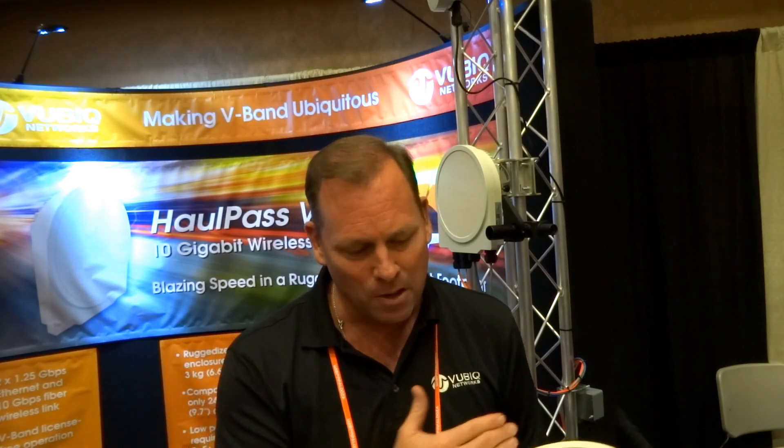If you're using the full 10-gig path, could you plug into one of the other ports for management? Absolutely. When you're going 10-gig, all you see is the MAC address, so it's good to know you can still manage it. The theory is that if you're investing in a 10-gig rooftop-to-rooftop radio, you're going to have a 10-gig switch on the premises anyway — so why have redundant switching built in? We followed what our customers were looking for.